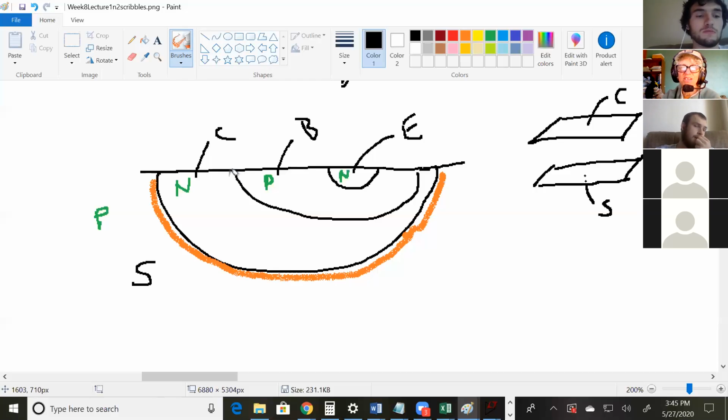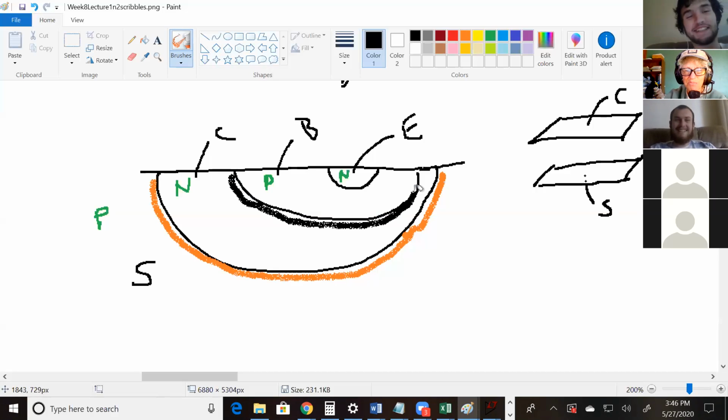If this transistor is in the forward active region, is this PN junction between the base and the collector conducting or not conducting? Not conducting. Yes, exactly. Apparently this depletion region is a different color, so that one's off. So that one too just looks like a parallel plate capacitor, whether you want it to or not. If you're operating a transistor in the normal region of operation, you have two capacitors here.